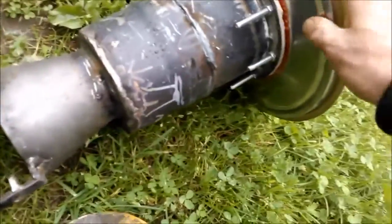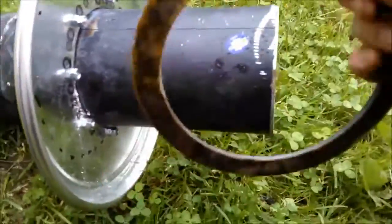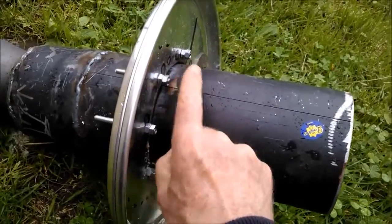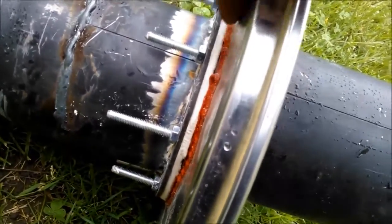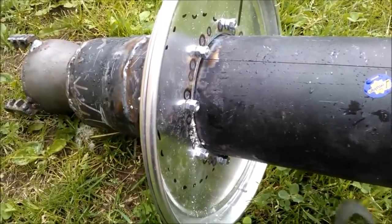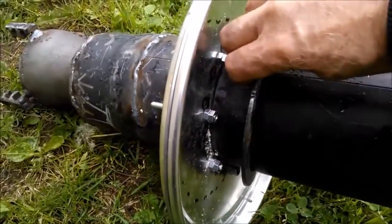One ring is welded to the stove pipe, and the other ring should have been perforated with matching holes and should slide over it. Together they should press the lid of this paint can firm and gas-tight, with the help of a seal in ceramic cardboard — you see it here. The guy didn't quite understand what I meant and spot-welded the lid to the lower one. Better is to have two rings and press them around the lid.